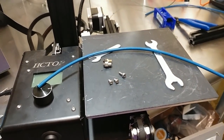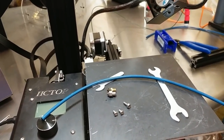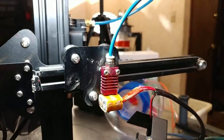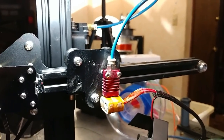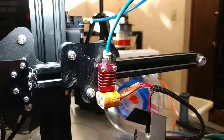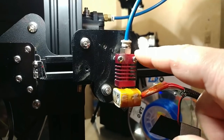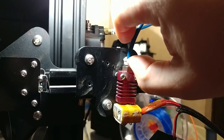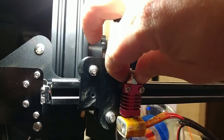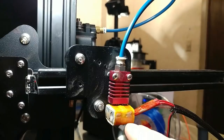Now I'm going to put the new nozzle in place, install the compression fitting back into the printer, and then install the new Bowden tube. New hotend is installed and ready to go. What I like to do is put the tube in first and see how far it goes in to make sure it's going in far enough and not catching something inside. Then I unscrew it a little bit, push the tube in, and finish the last two or three turns to make sure it's in there good — so there's no gap between the tube and the hotend, because that's where filament can fester.